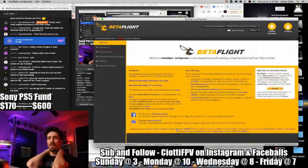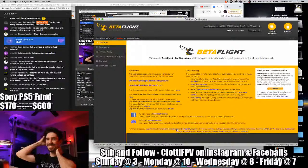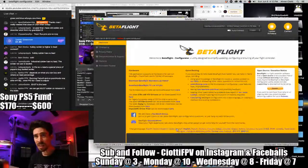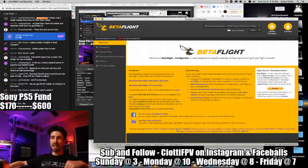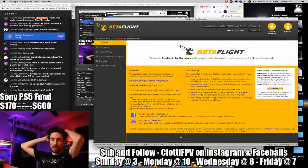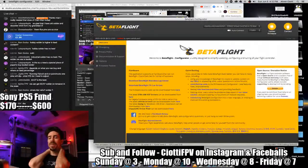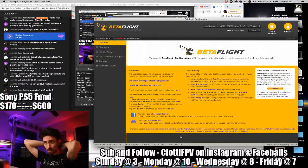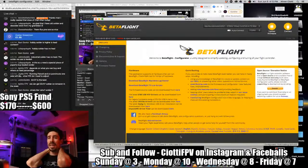Jabo, you need to switch to Betaflight. Falco does not have what you need, which is anti-gravity. In Betaflight it's called anti-gravity. Falco does not have that, and one of the big problems of not having anti-gravity is fixing that problem with the PIDs.